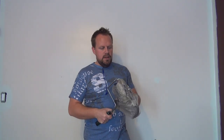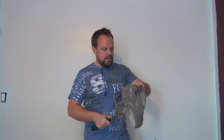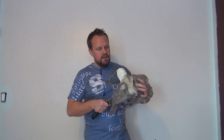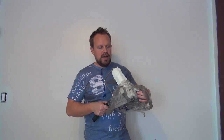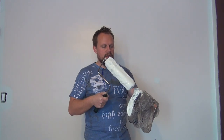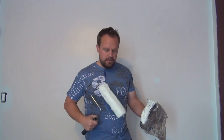Now it's time to roll your wall. One valuable tip I've learned over the years: when you're rolling a wall and you stop in the middle of a project, rather than throw away your roller or take time to clean it, you can put it in a plastic bag. This roller has been in a plastic bag for about seven days and it's still okay to use — so rather than take the time to clean it, I've got a roller ready to use.